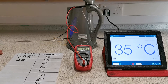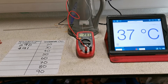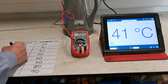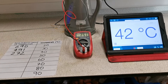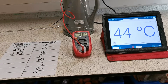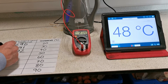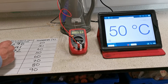We're going to keep a close eye on that resistance, looking for our next reading. 2192. So all we do is continue to do this until we reach 90 degrees, recording the resistance of the thermistor, which of course matches the temperature of the water. Looking for our next reading — 1194.